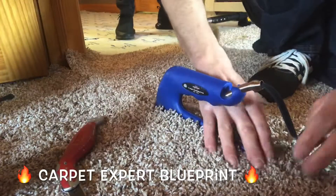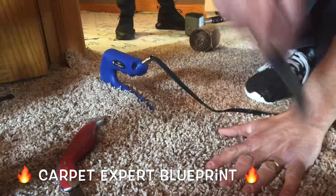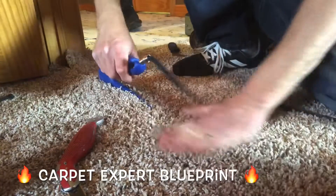Slide it in an iron's length before we get rid of any strings that may be coming along with it. Blend it in with your fingertips there — make it look pretty. If everything looks good, tuck in one side, take that iron, and slide it to the other edge of the door jamb.